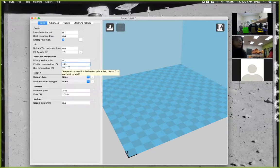And if you have PLA for your MakerBot, that it's the same size filament as this, it will work in this printer. So you can run it on this printer. So the filament you have on the MakerBot, you can. The Lulzbot, you can't because it's thicker. It's a thicker gauge. But the smaller filament, you can, as long as it's PLA. And the same thing goes for this filament in your MakerBot. You can run this in your MakerBot, too.